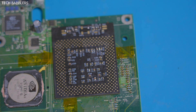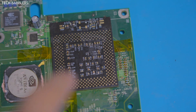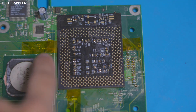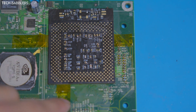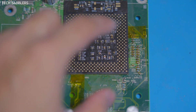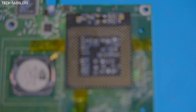Sorry for not recording much, but as you saw in the last shot, I reballed the interposer onto the board. I used 0.76 leaded balls — basically they come in a little tube. What you're seeing here is Kapton tape I used to make sure it's lined up. It's kind of crooked, but that's how it has to be. I taped the top and side of the motherboard, and the same for the interposer to make sure it lines up properly. It seems like it reballed fine.